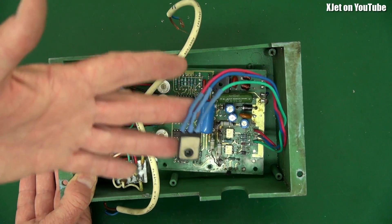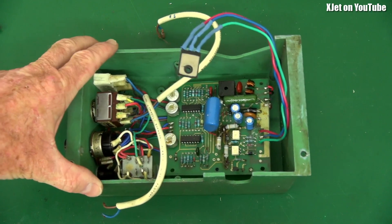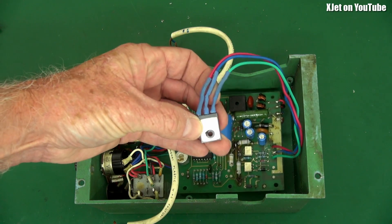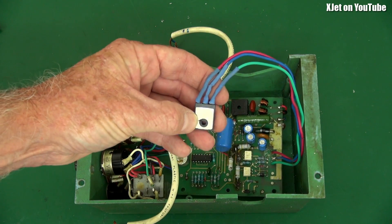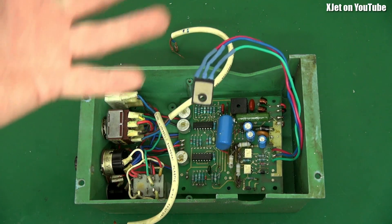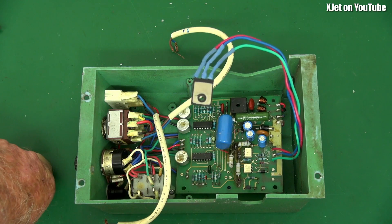What happened the other day was I went to use this lathe after probably three years of no use, turned it on, the fuse blew and the magic smoke came out. Something happened while it was just sitting there doing nothing. It seems the insulation between this FET and the headstock of the lathe — which it uses as a heat sink — broke down. There was an arc between the FET and the headstock, which took out the fuse. It may be nothing else on the board is damaged, just the fuse, or it could have taken out the MOSFET because I have replaced this before.